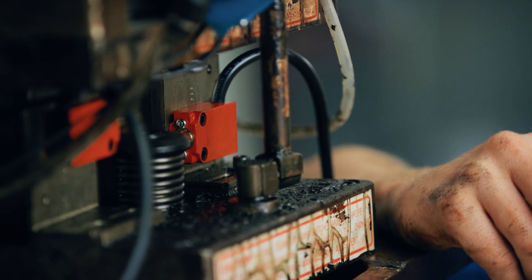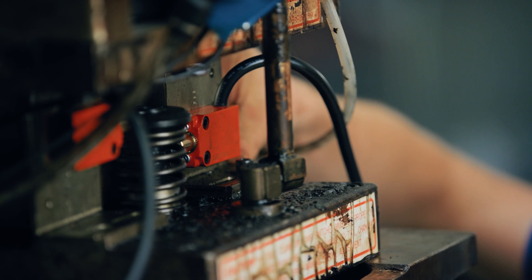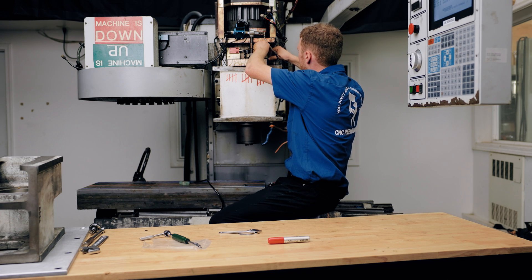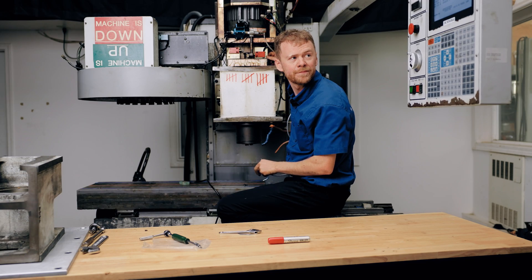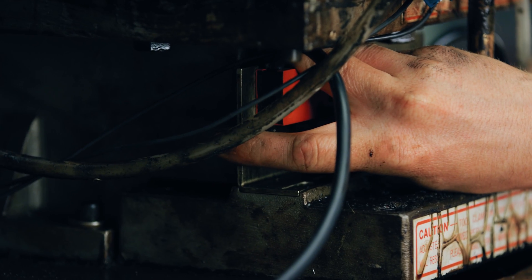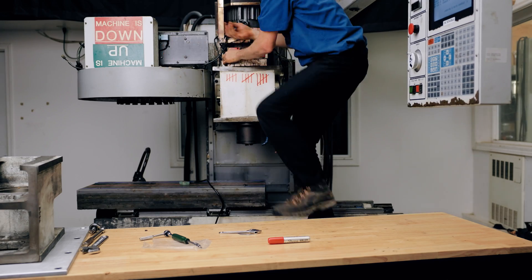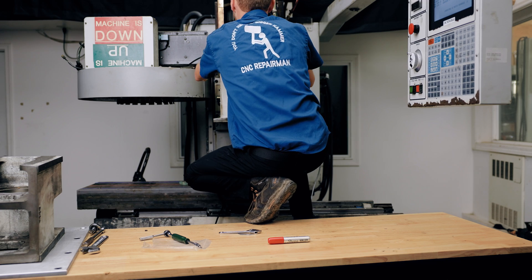Let's check it again — not far enough in, push it a little further. I've worked on a few machines where I couldn't get it close enough in and had to take the bracket over to a knee mill and machine out the bracket just a little bit. Try it one more time. Drawbar open — that one's working fine. Now let's go over here. We don't need to do anything for the upper one because it's already done. It needs to change to a one — that's the drawbar closed. I'm going to listen for the click, go a little bit further in, tighten down the screw, back it off just a hair. I don't want it all the way in. Then I'd put the other screw in.